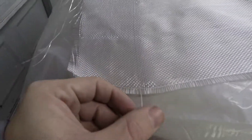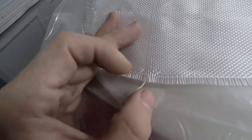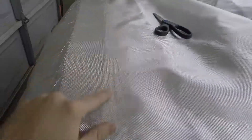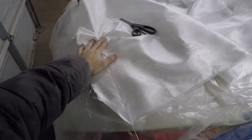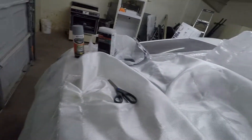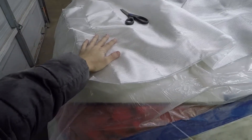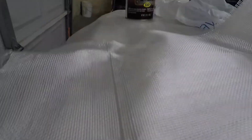One thing I figured out about these fiberglass cloths - as you can see, there isn't any kind of harsh line or anything, it just looks like a really nice cloth. In order to make a straight cut, if you take one of these little tiny fiberglass fibers and yank on it, it's going to leave a hard line right here, which I'm going to show you guys. If that's not satisfying, I don't know what is - we finally have a nice line cut right down the middle of this fiberglass cloth, which looks pretty good, to be honest.